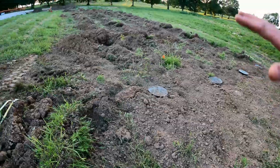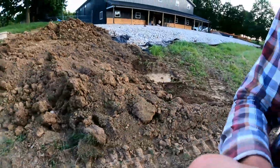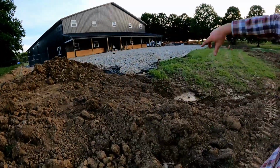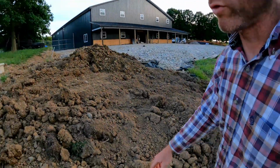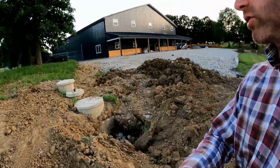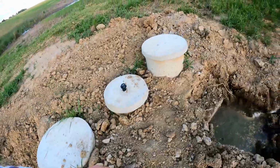We got really fortunate. We got a good soil condition, and we don't have a lot of plumbing fixtures, let's say, in the shop and in the offices. So it also allowed us to not have to have a gigantic septic field. That's 4 runs, 76 feet long, with those 22-inch by 8-inch low profile infiltrator chambers. They've got to expose both ends of this for the county to see.